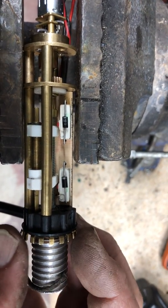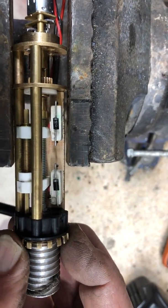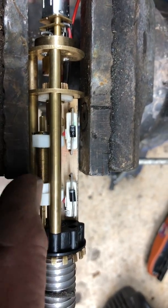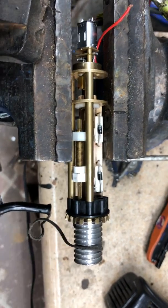So I hope that clarifies it. If you needed to adjust the total amount of wraps, you can adjust the spread on these two dogs by rotating this mechanism, which turns the square shaft here. It's turning that square shaft and initiates these threads, which spreads or collapses it. So that's my story and I'm sticking to it. If you have questions, ask Einstein.